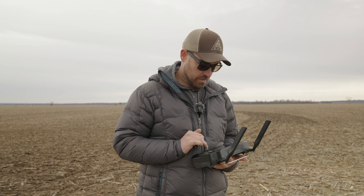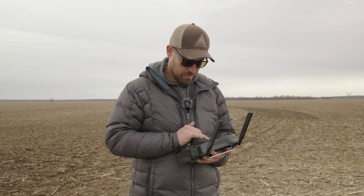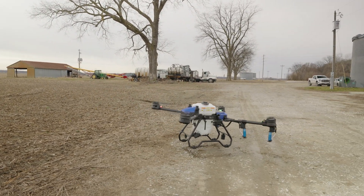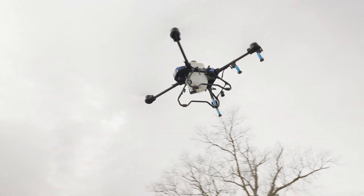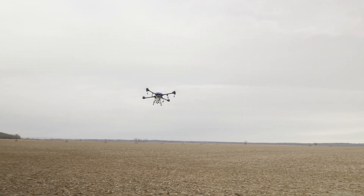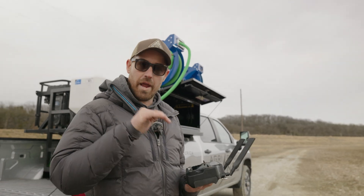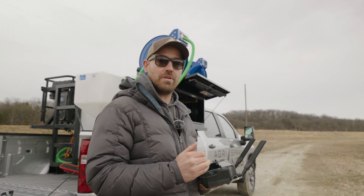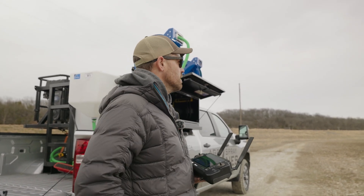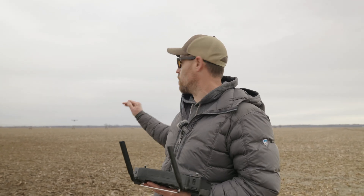Hit New Operation, takeoff, I confirm — and then we're going to slide to take off. Talking a little bit about speed while the drone is flying: this drone will terrain follow at 50.5 feet per second. You'll see if you have auto bypass on intelligent bypass, it will limit you to 32.8 feet per second — the way to do it is to take that off. So we're going to let it spray its boundary. The drone just finished its first boundary pass, so we're going to let the drone come home, get out of the way, let it land, and then I'll show you how to shift in and fly another boundary pass.